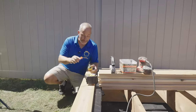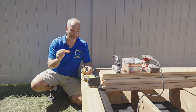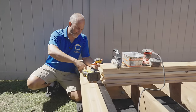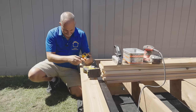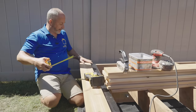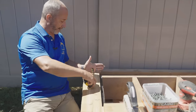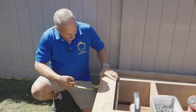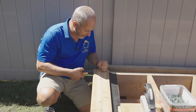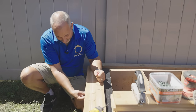All right, so in order to set this nosing up, remember I'm gonna take one of these 5/4 boards. We have at least one of them here that's like a real hockey stick. And when you cut it down the middle, it creates a nice little 2.5 inch piece. But that's 1 inch thick. So I want a 3/4 inch nosing, which means if I come off the edge of my deck here, because I'm gonna be adding that bench seating, 1 3/4. I know it sounds aggressive right now, but right here is the perfect location, okay? And then I'll add that other piece after the fact.